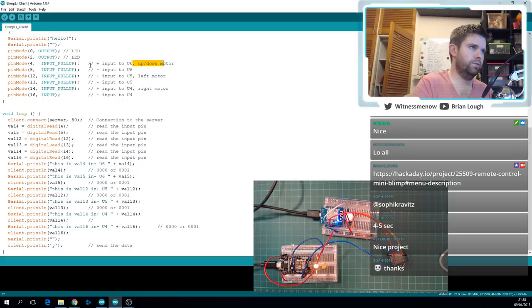Set the second least significant digit if U6 is, so that would reduce the payload, which, you know, mightn't be a huge difference, but it'd be interesting to see how much of a difference it makes. So instead of sending like 7 different values over the client, we're going to send just 1, and the server will be able to parse out the same information.